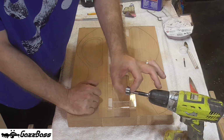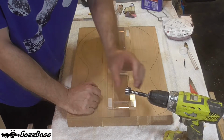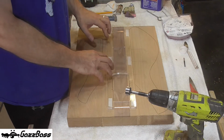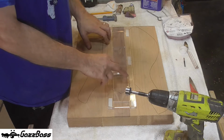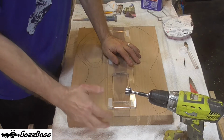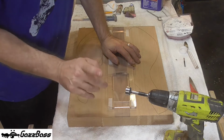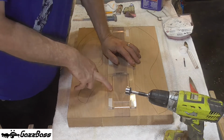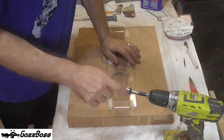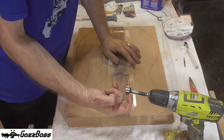Anyway, so that's half an inch deep, and that spike, the centre locator in the bit, is another tenth on that, so that's 0.6 of an inch. The Falcon Series 2 neck pocket depth on the 1 3/4 inch depth model, which is the two-in-one knot and oak, is 0.625 of an inch, or 5/8 of an inch. So I drill away till I get flush with the wood, the top of the Forstner bit.